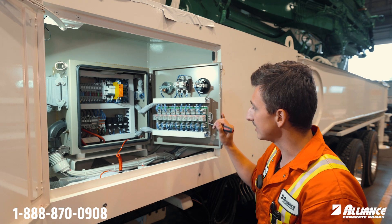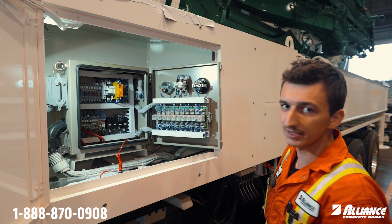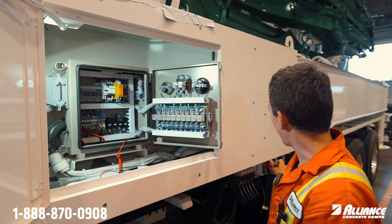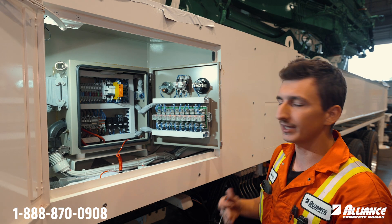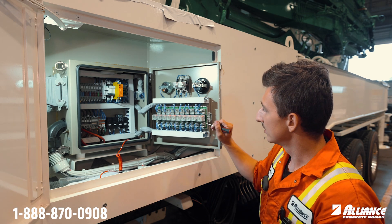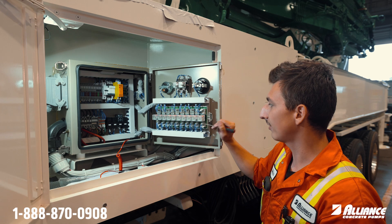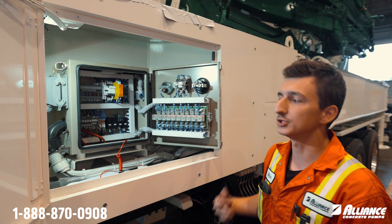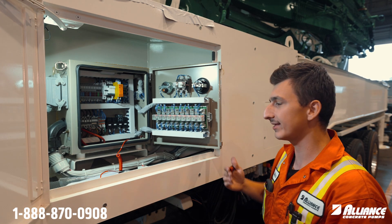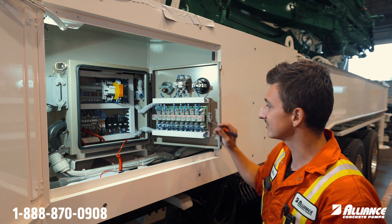Now for something like the e-stop relay where we're not getting ground, what that means is it could be an e-stop is hit. It could mean a broken wire or something like that, even a loose connection in the e-stop box itself. So if you don't see that green light, the relay is not active. Obviously you want to make sure the relay should be active — if you're trying to diagnose a relay that's not turning on when it's not supposed to be on, you're gonna be chasing your tail.